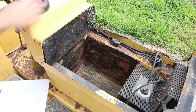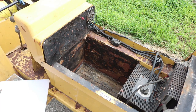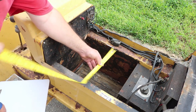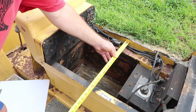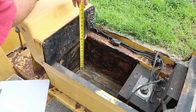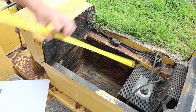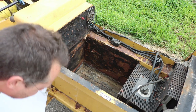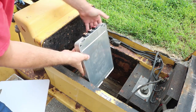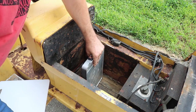The front of this lawn tractor would normally have two large six-volt batteries in here, golf cart style. If we look, it's about 11 inches across, almost 17 inches wide in the top part, and the full depth all the way up to the hood is about 18 inches. I have a couple of Nissan Leaf cell modules and I think those would probably go in here pretty nicely.